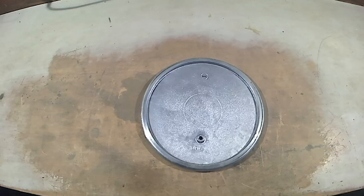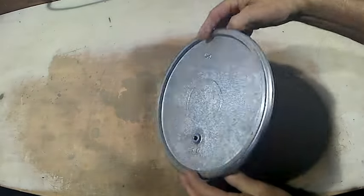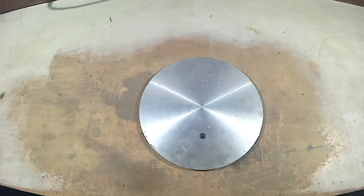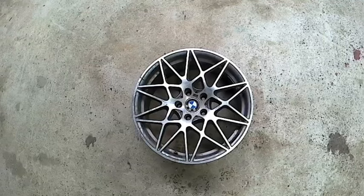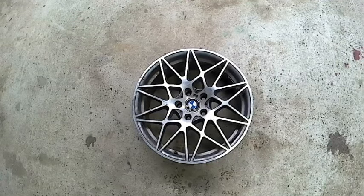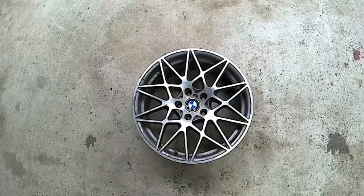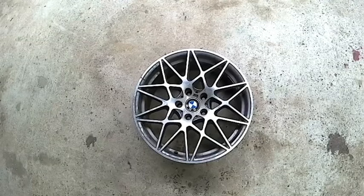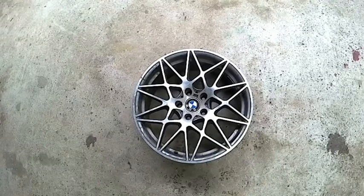This is the scrap aluminium that caused so many problems with the two castings in this video. It was given to me by a friend — they're four hubcaps, and to me they seemed like the best scrap metal you can melt because they are clean. I had no idea this would cause so many problems. My go-to scrap has been car rims for many years, but they take a lot of work to cut into small pieces. I used that unknown scrap thinking it wasn't a problem because I couldn't be bothered cutting up a car rim — and see what trouble it caused me.